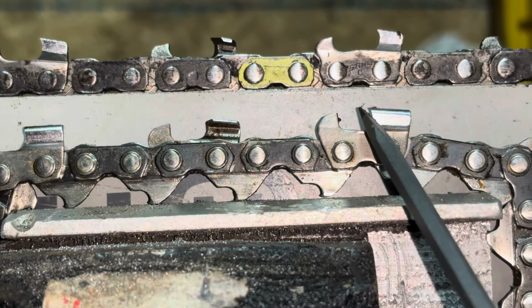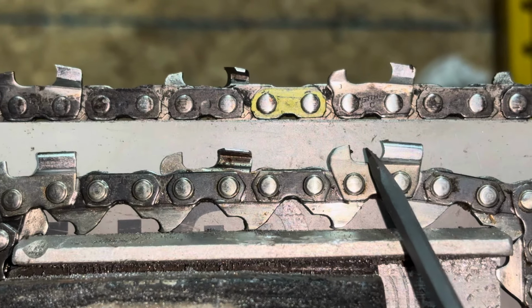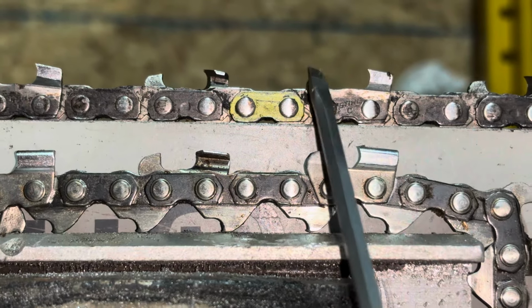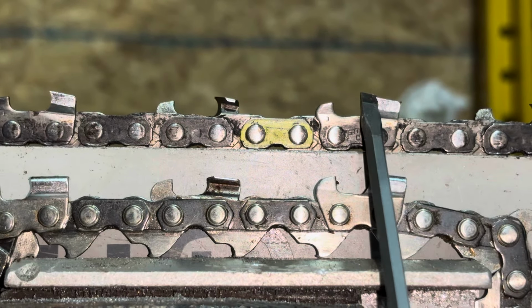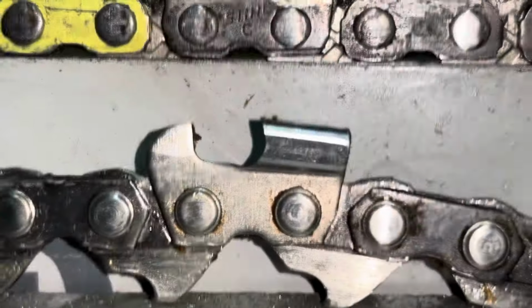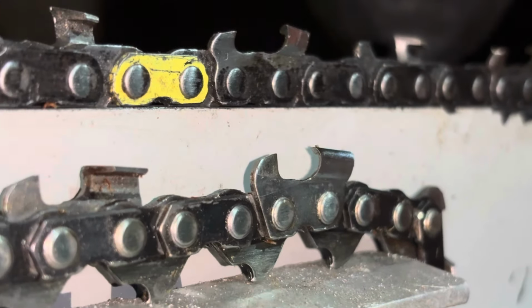That's because this doesn't come to an actual sharp point, it comes more to a rounded, sharpened edge, which just leads to a stronger edge with more material supporting it, as it doesn't have that very sharp, fine point right at the end, right there. This does have a point, but it's not as sharp, and it's much better supported, as you can see right there, versus right there. Come over to the side, you can see that has a much shallower angle.